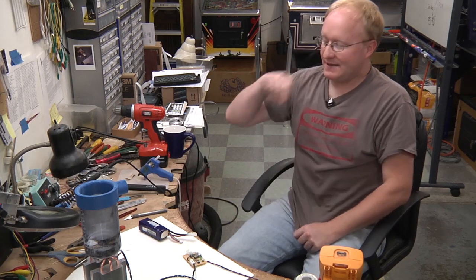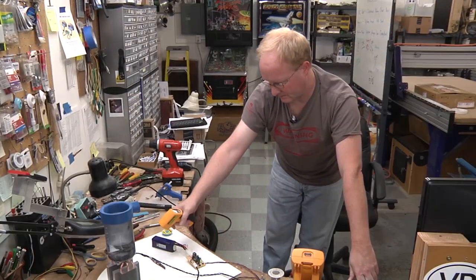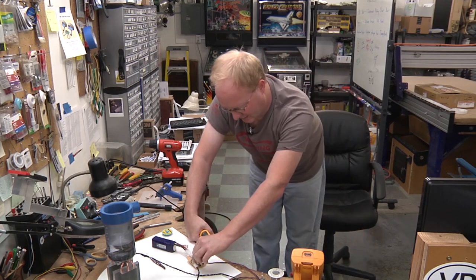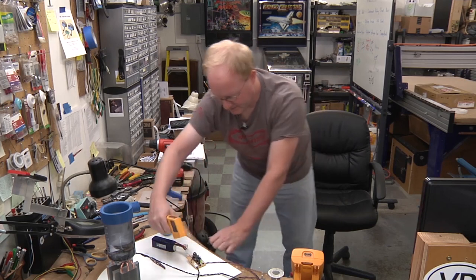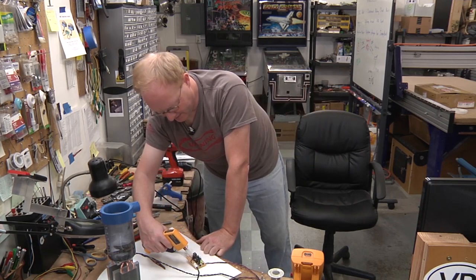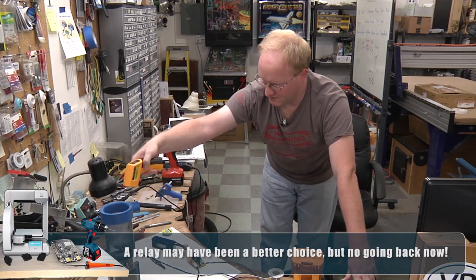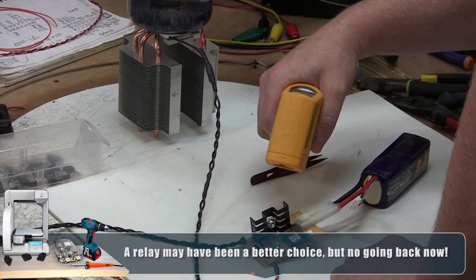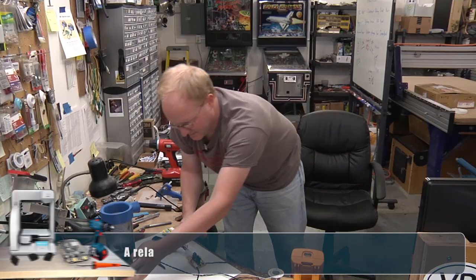Okay, I'm going to check the value of my potentiometer and then wire this circuit so I can't possibly go above that value. At least the batteries didn't explode. I put a slightly larger MOSFET on, an IRL540, along with the heatsink and some thermal paste. It still gets warm, but it looks like it's stable, at least. I dumped a bunch of hot water that I microwaved in here, just so I could see a really obvious transfer of heat.